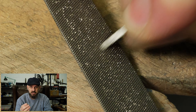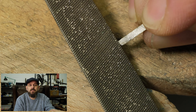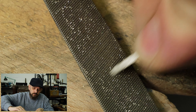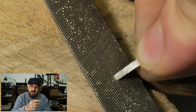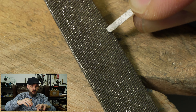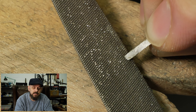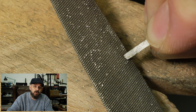Even if you mainly work with platinum or gold, still use silver for this — there's no point using more expensive metal. This piece is about a two-millimetre bit of sheet, just an off-cut corner. Hold it on a sharp bit and go sideways. After two or three passes going perpendicular to the length of the file, working down the grooves, that corner of the sheet will actually take the shape of whatever cut file you're using. Then simply do a couple of strokes up and down until you've covered all of it.